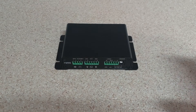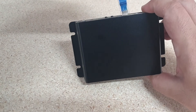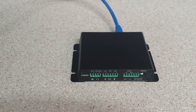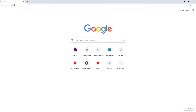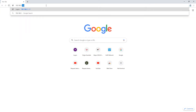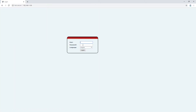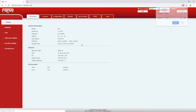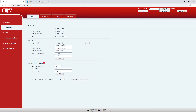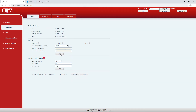Next let's get this hooked up to POE so we can power it up and have a look at the web interface and start getting it configured. By default our Fanville PA2 gateway will be configured with a static address of 192.168.1.128. We can log in with the default username and password of admin admin. The first thing I'm going to do is jump into my network settings and set this one to DHCP so I can get it talking to my existing network.